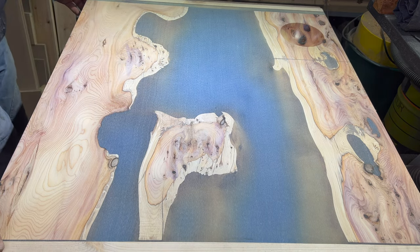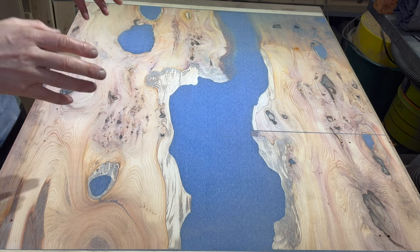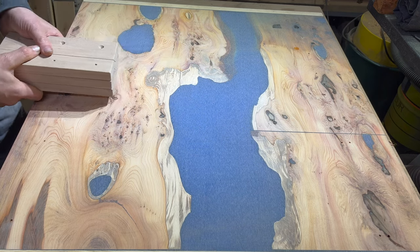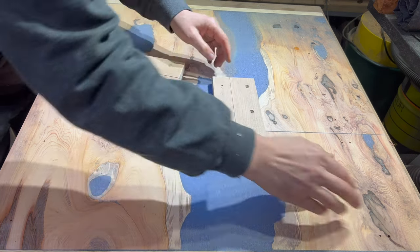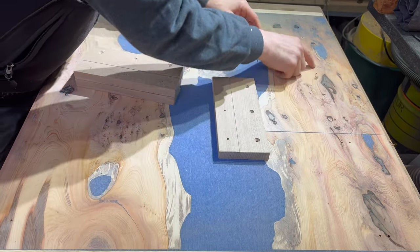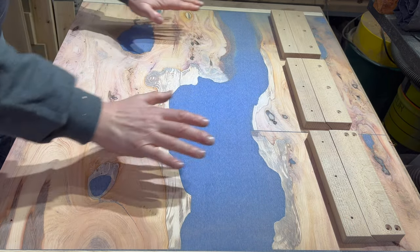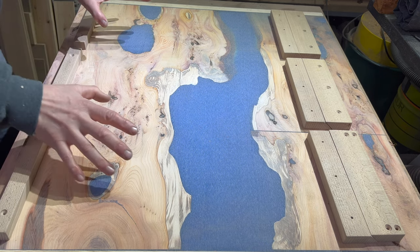I might play with that. The last one I did, I did the 600 grit to give it kind of a misty look on top of the resin, and that actually worked really well — not everything has to be high polish. First off, I want to talk about the back. You've seen me do French cleats before. I've had whinges about the type of wood I use for the French cleats being a soft wood and not being very pretty, so I use some nice beech — not that it's going to be seen, but it's nice, hard and strong. I've drilled these — on this one with the bowl I've put a drill hole either side of the bowl; on the other ones there's three going across.